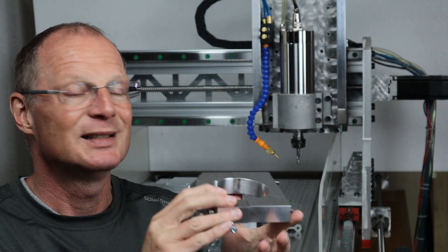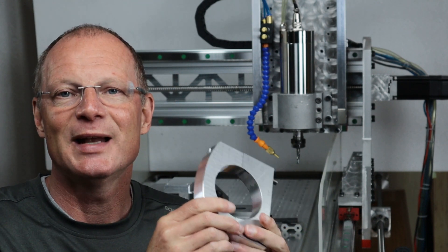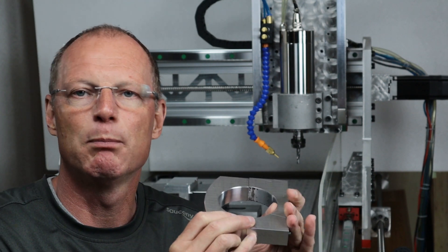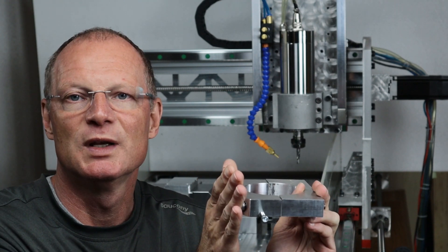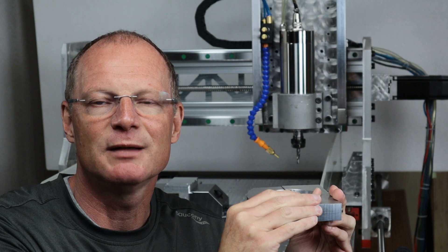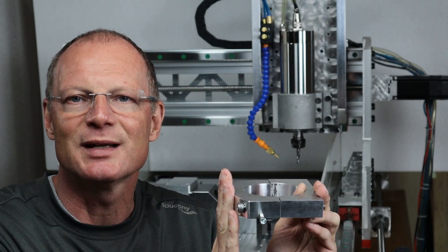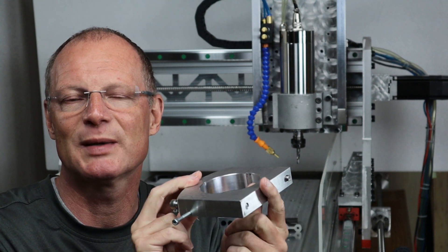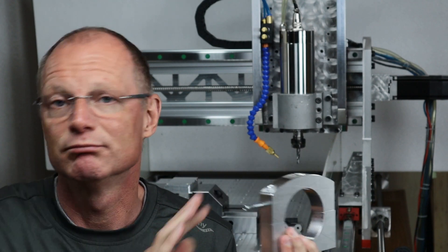This is an additional clamp — it is not meant as the main clamp. The main clamp needs to have mounting bolts that are independent from the clamping bolts. We want to mount the bracket, and that is one aspect of the holding, and the clamping is another. In this bracket both are combined because the bolts come out the back, so it's really just the additional top bracket.